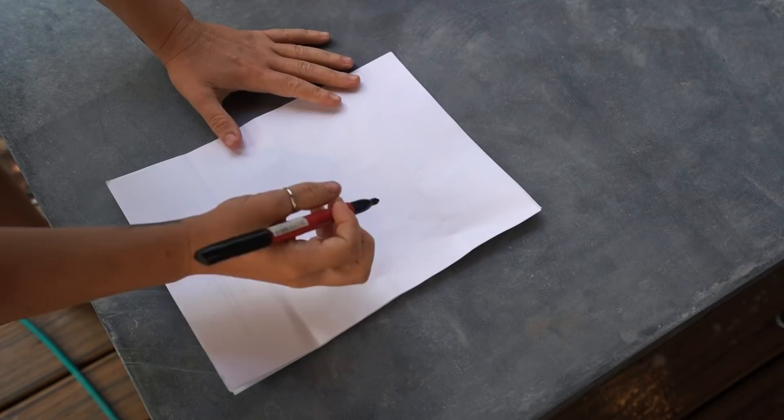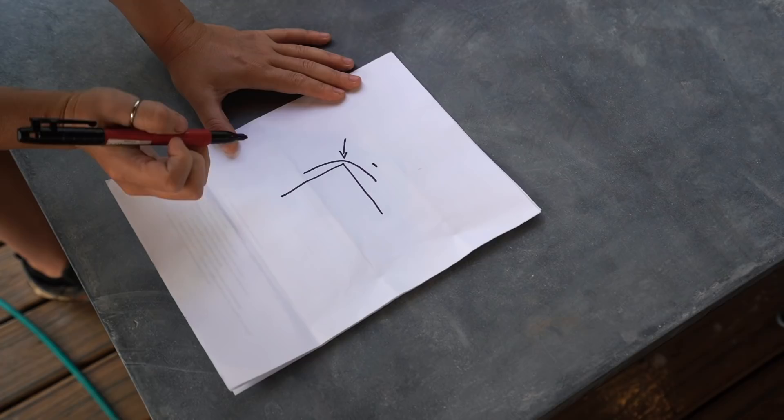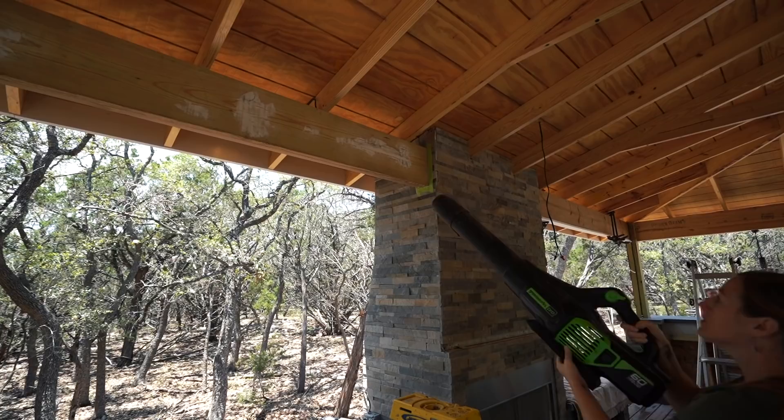This is a simple thing but it makes a difference: ease sharp corners. Think of paint as a sheet of plastic film — that's really what it is. Sharp corners create a weak spot where the film will eventually break open. If you slightly round the sharp edges with sandpaper, it eliminates that weak spot. It might seem tedious but it really only takes a few swipes. After sanding, clean up all surfaces.